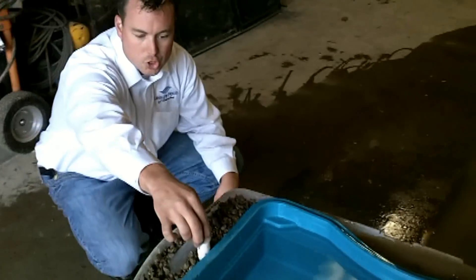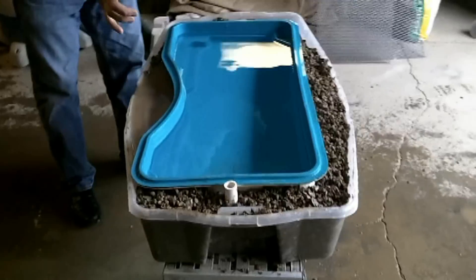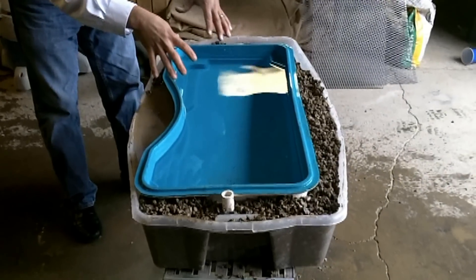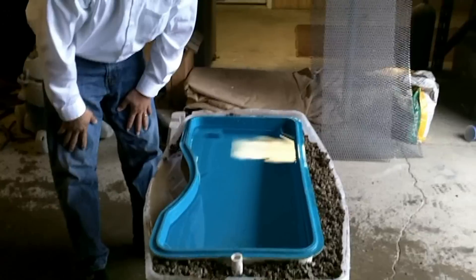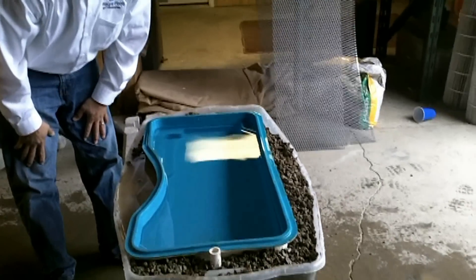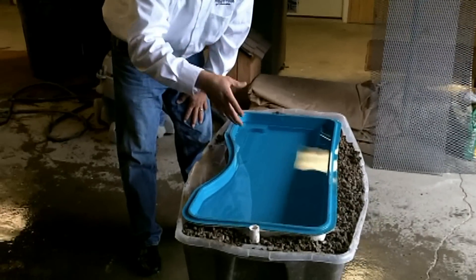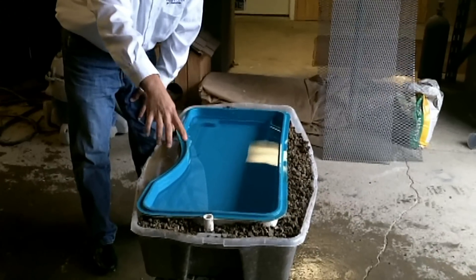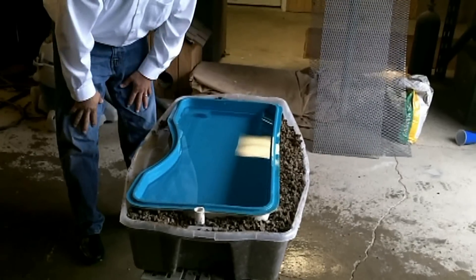With the addition of a sump pit, should that need ever arise, by placing a pump in that pit you've got access to all of the water in the hole. There are very few situations where you need to drain a fiberglass pool. We did have one a couple of years ago — a customer had a house fire, the fire department threw stuff in the pool. We needed to drain that pool, and using the sump to access the water around it, we were able to safely drain it.